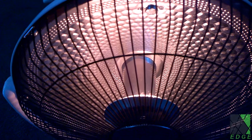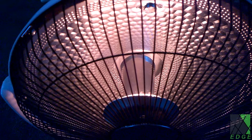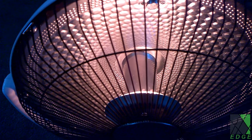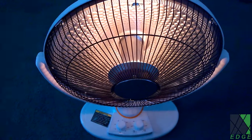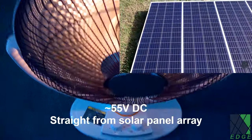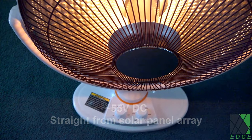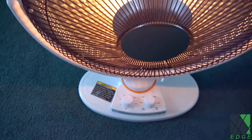This is a space heater that can run directly off of solar panels and consume DC power directly — no electronics, no battery, no inverter. It's a nice easy DIY project. It's actually the Harbor Freight Parabolic Infrared Space Heater. This heater is running off of a direct solar power feed. The knobs, switch gear, timer, and oscillation motor are not compatible with DC and cannot be used — you can either leave them in the heater or remove them, but it doesn't matter.